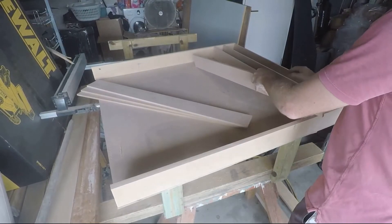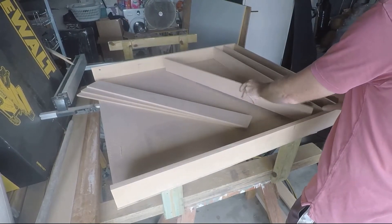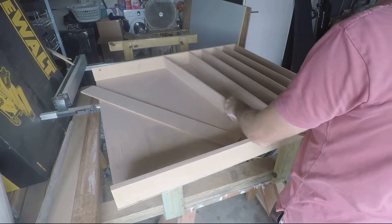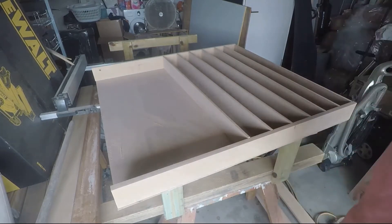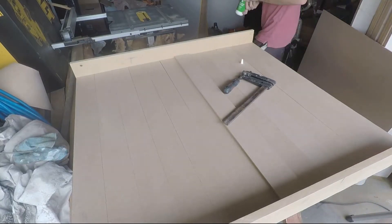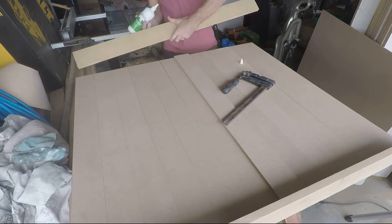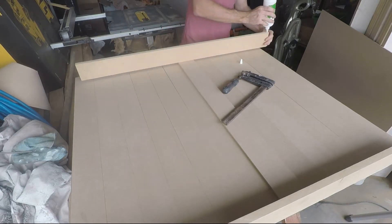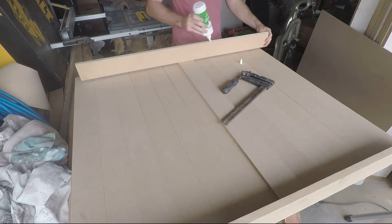Next I just laid out each fin to make sure that the top and bottom plates aren't sticking over the edges. Generally you space each fin about 2 inches or 50mm apart. In my case I'll be spreading them around 70mm apart given the space that I have for them.